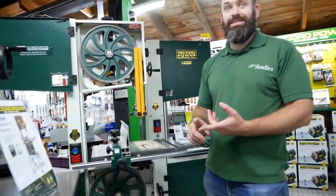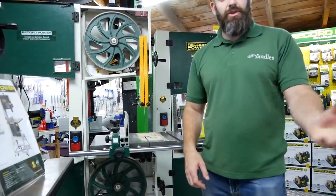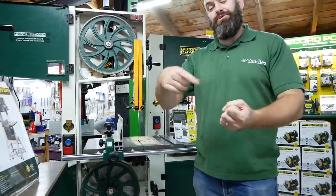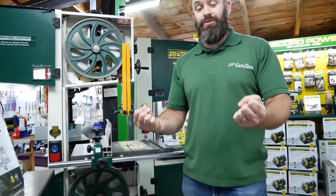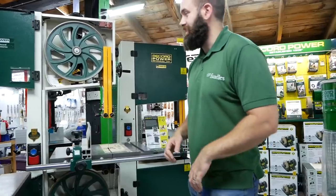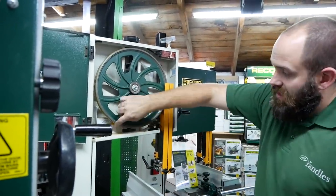Taking a new blade out of a packet — first things first is wear gloves. Take it out of the packet, undo the different loops, and then either go outside or find somewhere, just throw it on the floor and let it uncoil itself. This is why I say wear gloves — you'll do like I do: uncoil it and then realize you're holding it with bare hands and the tension wants to open, and all you can do is drop it anyway. So just throw it — so it lands back down, not blades-down on concrete. Once it's open, depending on the size of the blade, you hook it in and loop it onto your wheel, top and bottom, and it's got a little tire.